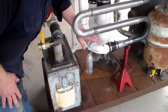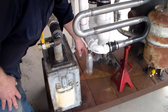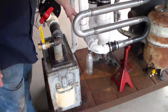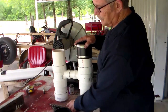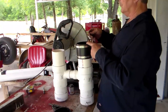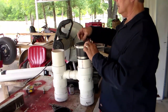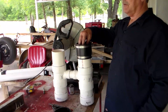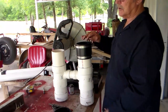As it exits the radiator or cooling core it's going to come across here, and any moisture that has collected I'm hoping will empty itself into this bottle. After that it's going to go into my first stage filter — this is the lower half of my gasification filters, and I have about a total of five foot. I have a joint here and I'm going to put a screen in because my media is going on top, and I don't want it falling down. This section is going to be catching water and ash and things like that.